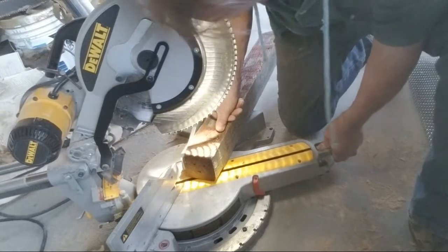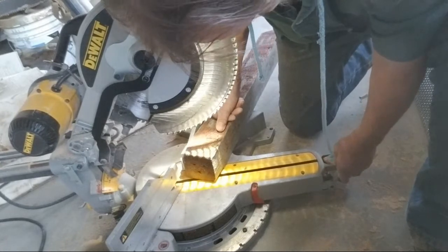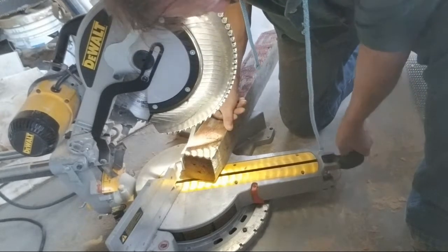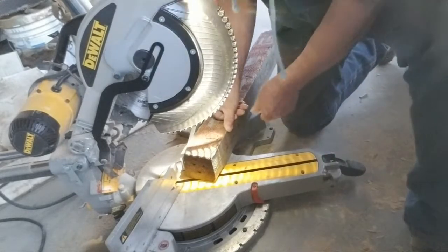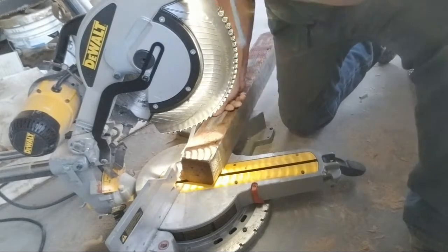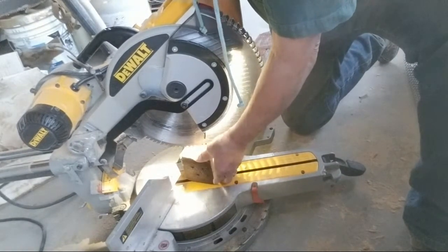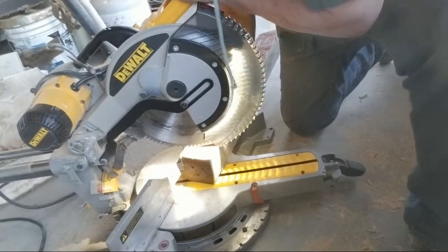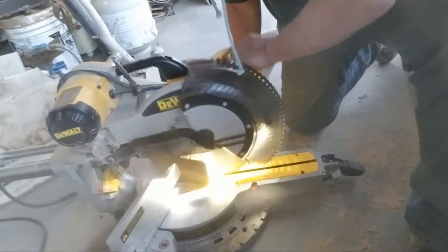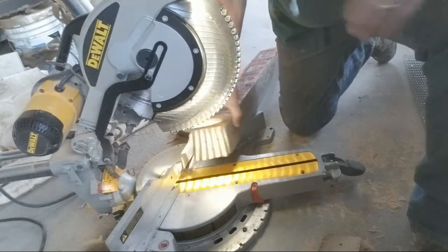Half of 44 gets 22 and a half. All right. We're going to make it 22. Well, 22 and a half would make it 45. It'd be a slight back. No, so we're going to do right there. All right. Now we're going to bring this up here to this angle. Then I'm going to mount it to a post when I'm done. Okay. There we go. You want to press down on the table and back to the fence when you cut. Okay, well, there's that angle.